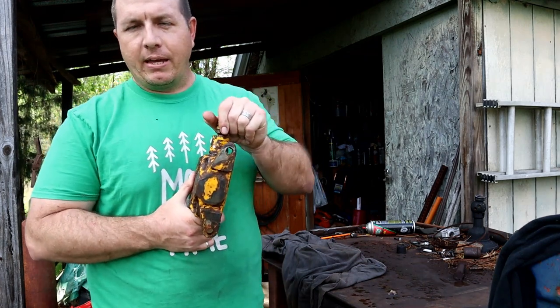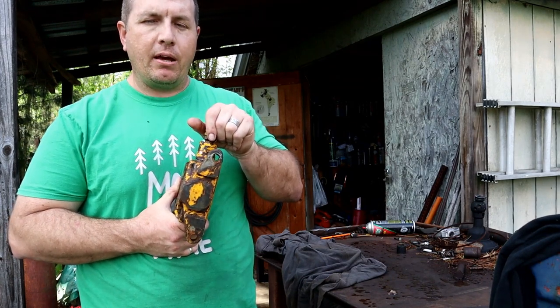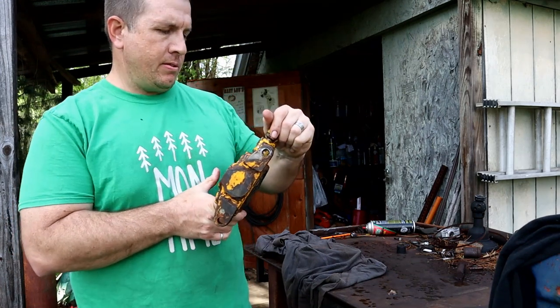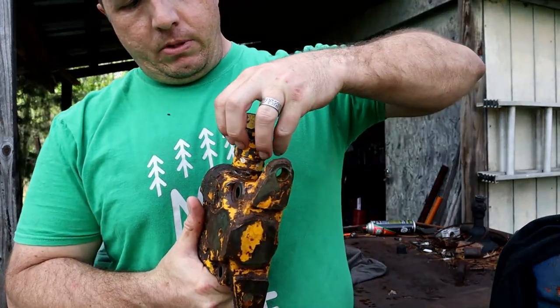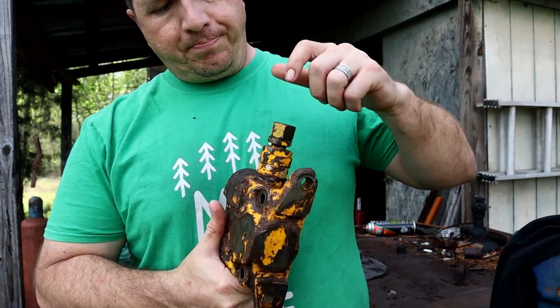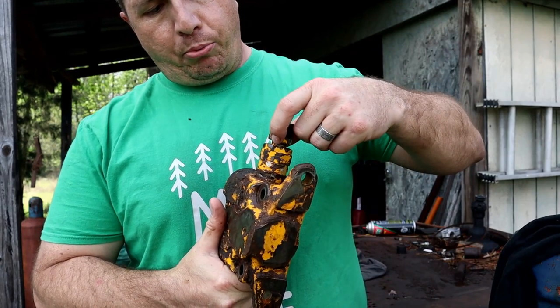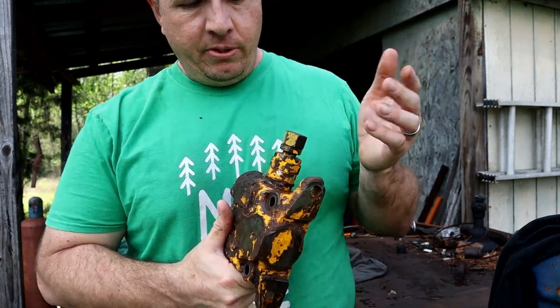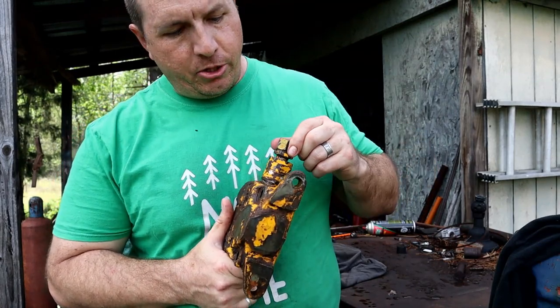And at that point, I just decided it's time for the nuclear option. I've got to take this off. And if I need to take the entire valve body off, now it's a little bit easier and a little less heavy, I guess. But anyways, the process here is going to be to get this whole thing disassembled. From that picture, it's got basically a keeper, spring, valve, and then keeper, spring, valve from the other side, plus some other stuff. Okay, so let's see if we can get this disassembled off there without doing any more damage.